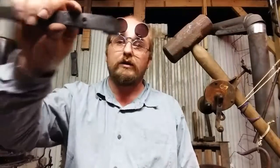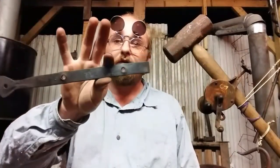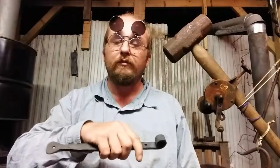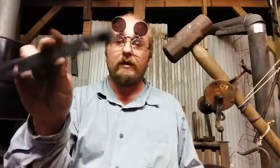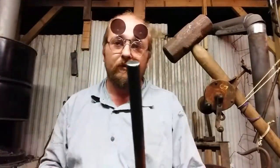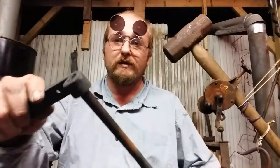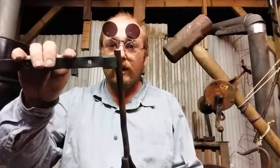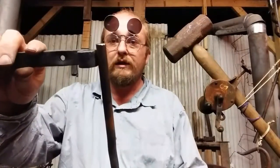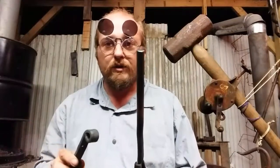This one's going to be just a little bit different. I'm going to go ahead and flatten the portion out, turn the 90, step it out to where it can actually move, and be fastened in the same way as the hinge to the frame. So we're going to make a little pintle pivot for this hinge. As promised, this is the size stock that was used — it's a little snug, but that's good. That means it'll stay where I put it. So what we've got to do is heat this up, bend that 90 degrees, and that's where we're going to start.